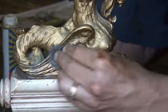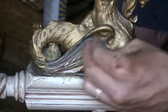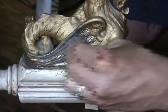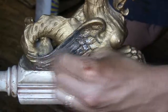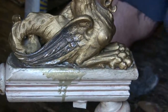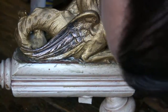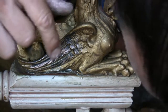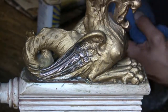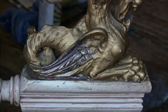Ooh — I see something coming through. Hold on. How do we test for zinc? Zinc is non-magnetic. I know that zinc looks like aluminum when it's exposed. That's not brass like the feet are — it's got a silvery shine to it. I'm wondering if it could even just be cast spelter or white metal. It doesn't look like steel; it's too pitted.